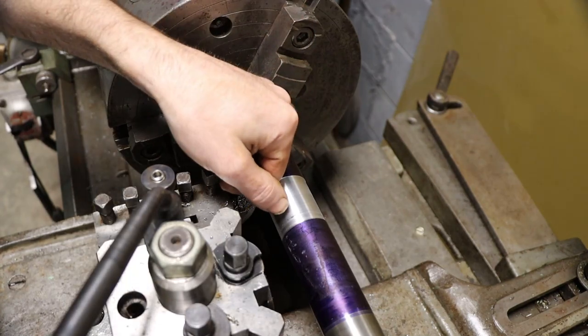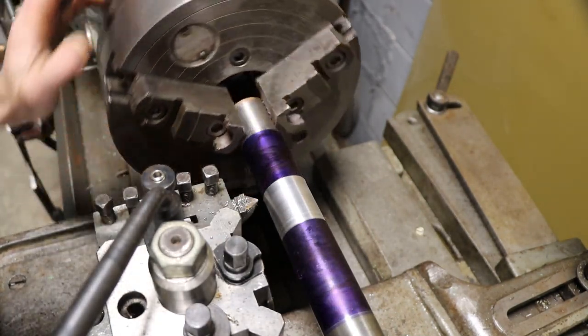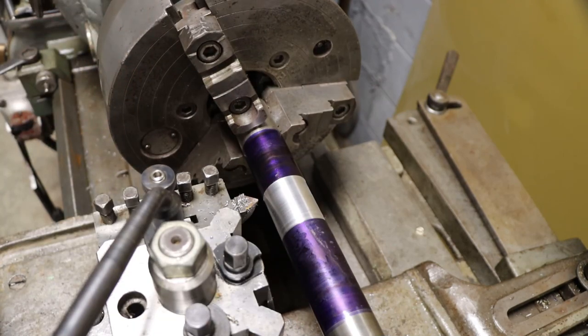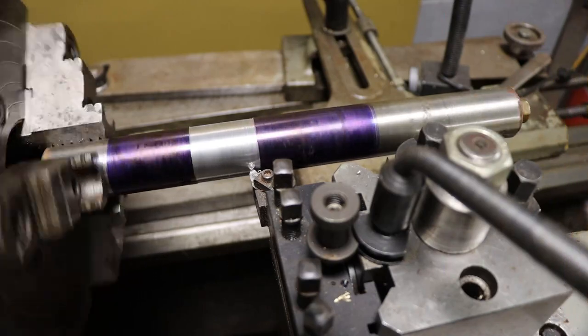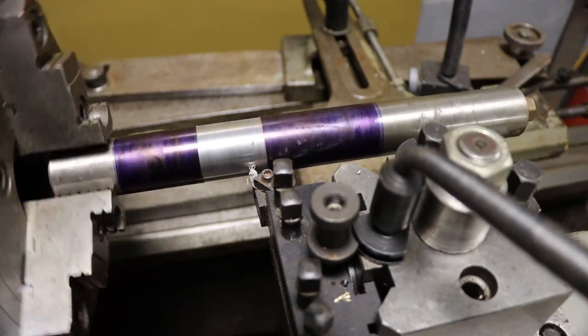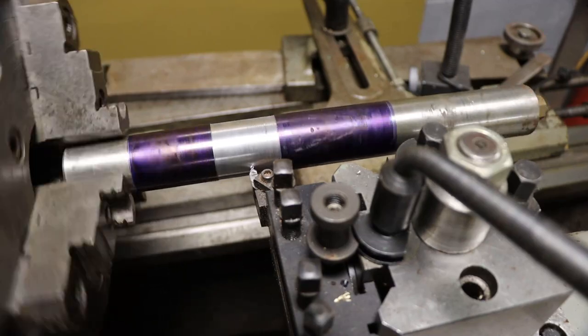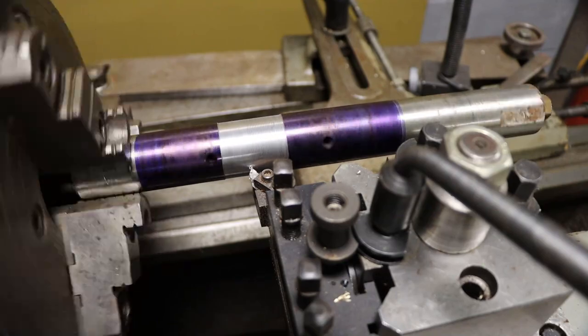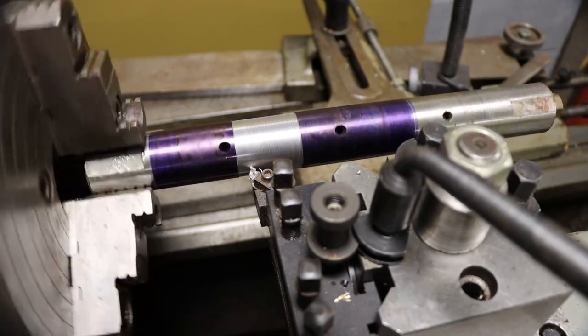Yeah. Other than that little spot there, we got to the bottom of the damage. 25 thousandths. So like I mentioned, the light thread pass here, manual recommends anywhere from 15 to 30 threads per inch, and we just did 28. So just a light thread pass to increase the surface area of the place that we're gonna build up.